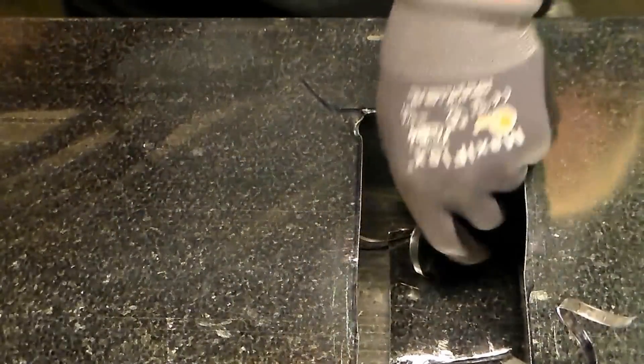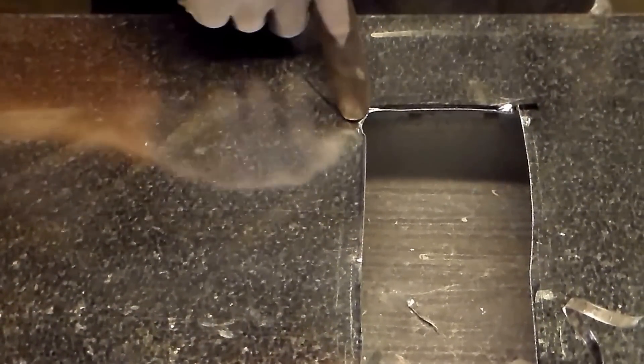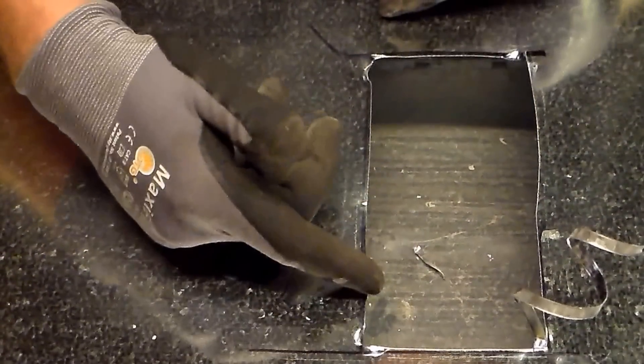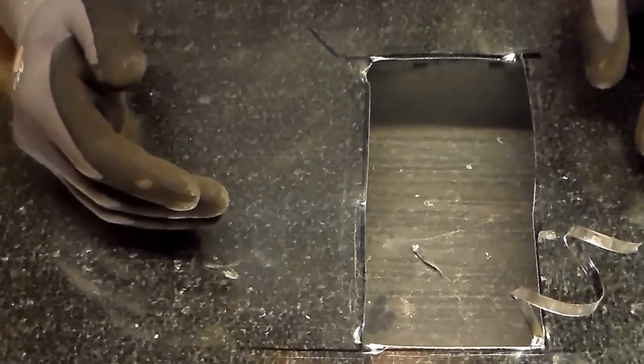Not the cleanest in the world — you leave yourself some stitches, or 'stitch-gators' as I like to call them. But you can always trim this out. You can always leave a little more where you're pivoting, but it's not ideal for a smaller hole like this. It's more ideal for a bigger hole if that's your application. I'd recommend using snips on a smaller hole.